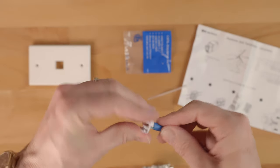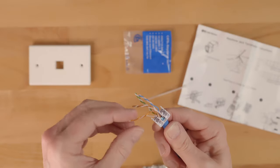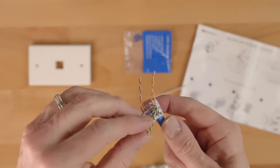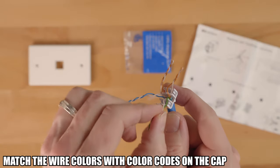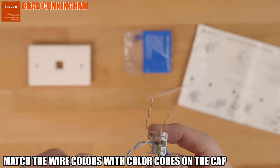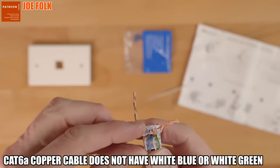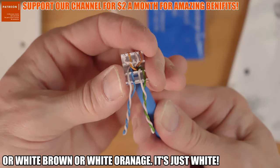For the tool free option, we're going to use this white wire cap. It's already color coded for the correct wire configurations, and it has both A and B — and we're going to use B. So after you slide the wires through the cap, simply match up the wire colors to the color codes on the cap. At the bottom it goes: white, blue, blue, white, green, green. Remember, CAT6A copper cable does not have the typical white-blue — it's just white, as you can see right here.